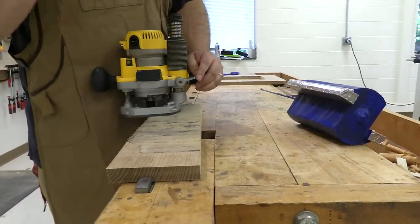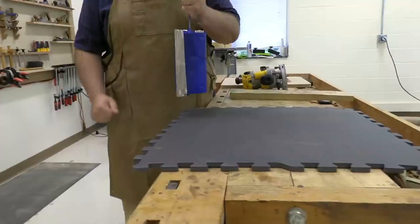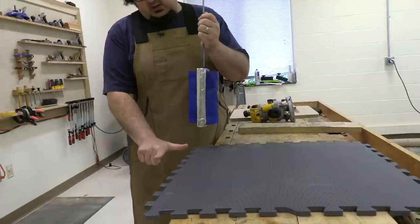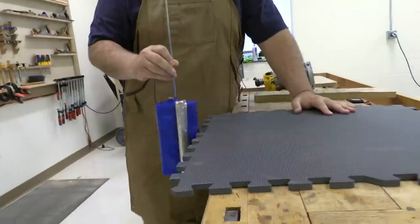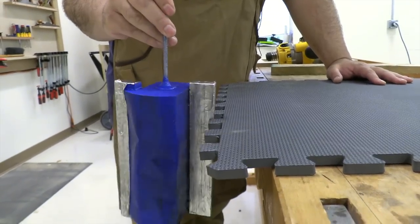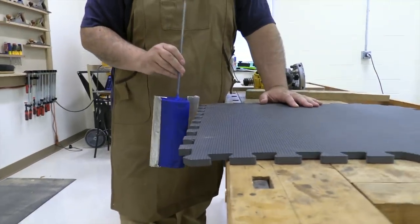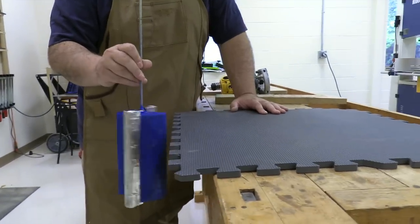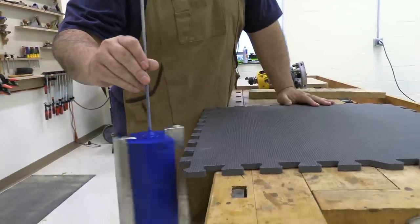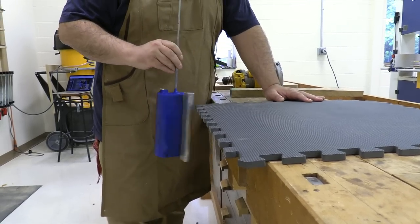Now that we've got that conventional cut down, let's talk about what the router bit is doing when that happens. This is our router — it is spinning clockwise because it's handheld. Thumb, finger, that direction. You can see that the bit is hitting and it is cutting wood. The only thing moving it in this direction is me — there is no other force moving this bit forward other than me. Now, if we go in the wrong direction, it's going to bite and cut wood, but it is also going to propel itself in the direction we're going.